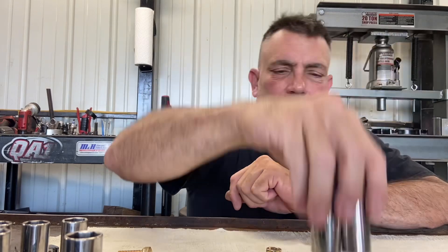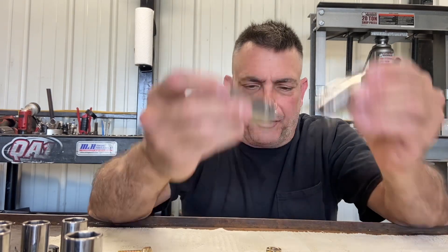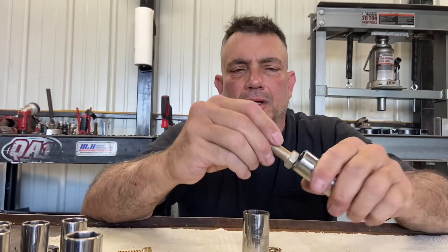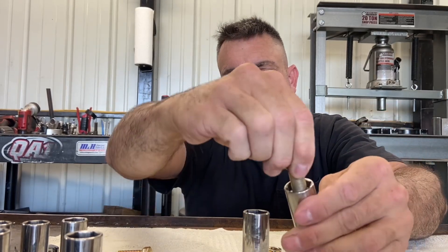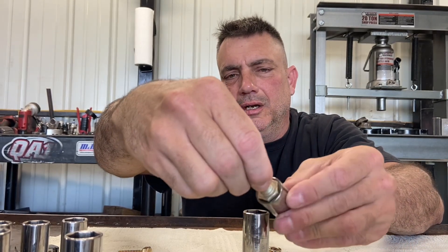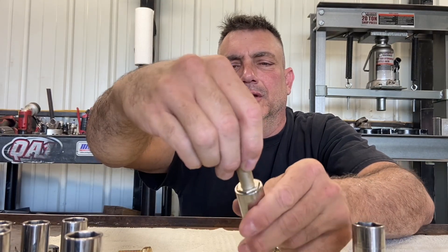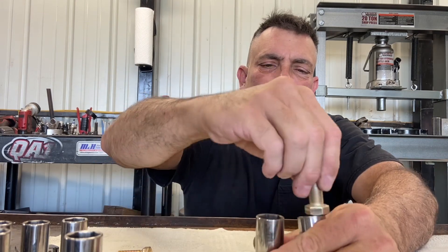This is probably one of the most common ones that people use because of wheel lugs or lug nuts. There's your 19 and your 3/4-inch — these are pretty much exactly the same size. You can see the amount of motion in there with the 3/4-inch. The 19 is actually a slight bit smaller than your 3/4, but those are pretty much the same size.